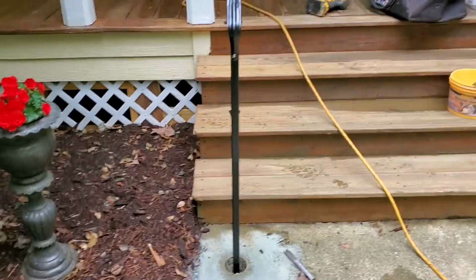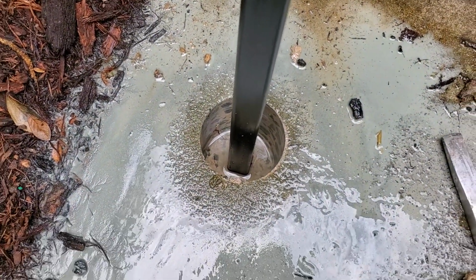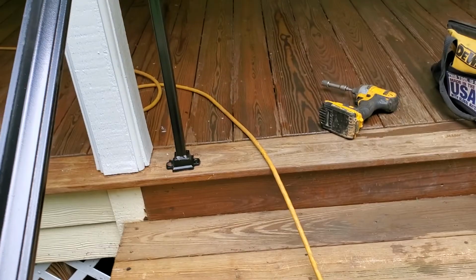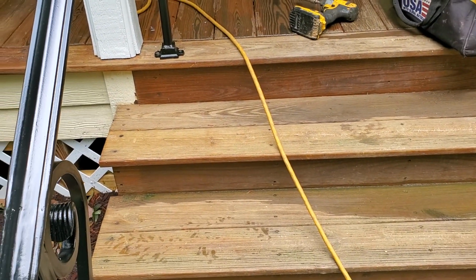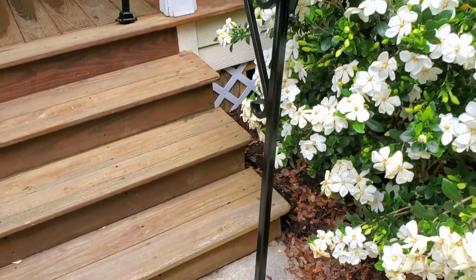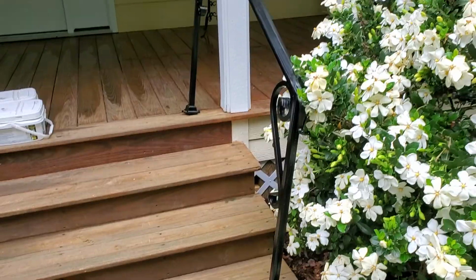Now, I'll show you how deep that pocket is and how nice a clean cut. So when I pour that rail set in there, it stays where you put it. And I'll do the same up here. Lag bolts hold that in place before I pour the rail set. So guys, I'll show you maybe the end results on a comeback and clean up. But I'm going to set this one.